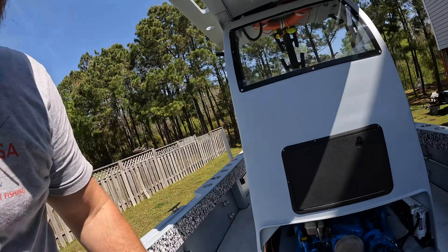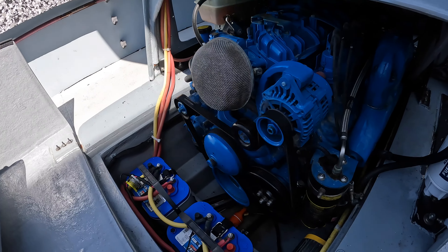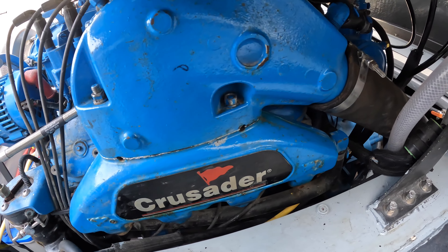So far so good — it definitely sounds a lot smoother. I believe it's really getting better fuel than what it was. Replacing that filter definitely needed to happen, but I went ahead and replaced the pumps as well just because they've been sitting for over a year. Sounds good, everything looks good. I'm going to let it run for a little bit and then probably next video I'll post will be on the water. God bless, have a blessed day.